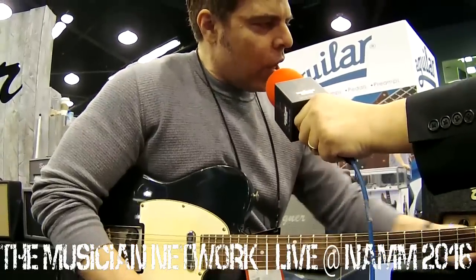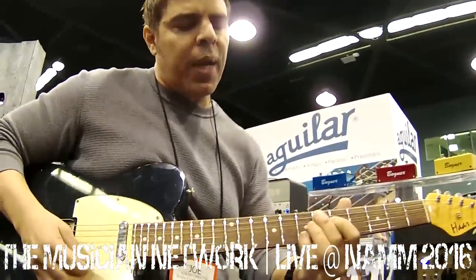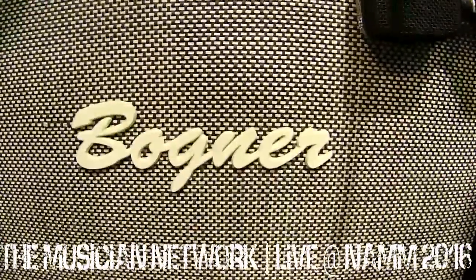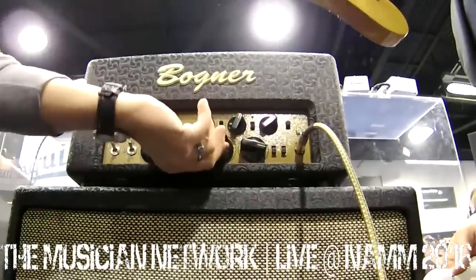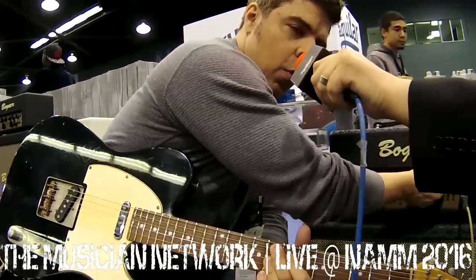If you want to get a little bit more volume, you can turn up the loudness. You can add the other tubes in — if I add in the 6V6s, you'll hear a little bit of a volume boost and it'll get a little bit gritty, it'll break up a bit more. You can tell it's a little bit grittier. If you want to dirty up the sound, keep the 6V6s in, maybe take the 6L6s out, put on the boost, and with the trim pot turned up and the gain a little higher, you can get a grittier tone. You can hear how the mids kind of come out with that switch.